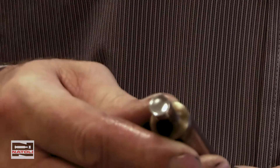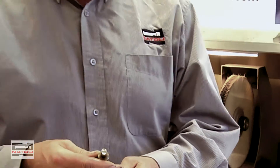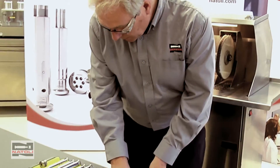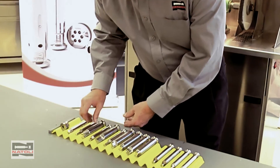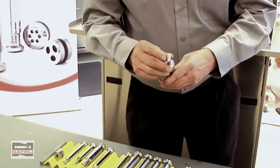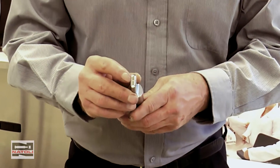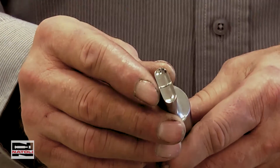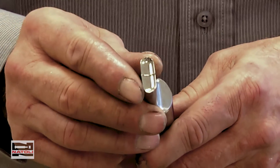To repair J-hook, it's very simple by using the buffing wheel, and I'm going to show you how to do that shortly. Another problem in the industry is that special shape tooling starts losing its edge and getting too sharp, which can create a breaking point. I'm going to show you how to repair and repolish that as well.